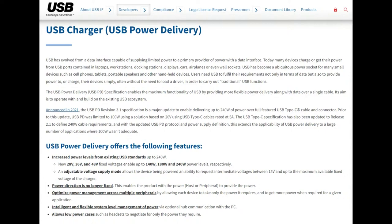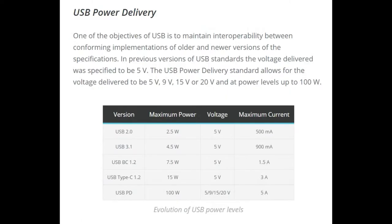Basically you can get up to 100 or even 200 watts of power at different voltages, and it's one plug. The client device — not the power supply but the power sink — negotiates: it tells the supply how much power, how much current, how much voltage it needs, and then the power delivery device does its best. USB 2 was supposed to be 2.5 watts but people used it at around 5 watts. USB Type-C you can get up to 5 volts at 3 amps. And then PD, which is very common now — almost everything is USB PD — 100 watts is easy, with multiple different voltages. That's great if you have devices with 8.4 volt battery packs needing 9 or 12 volts to charge, or a laptop, monitor, pump — anything needing up to 100 watts of power over USB-C.